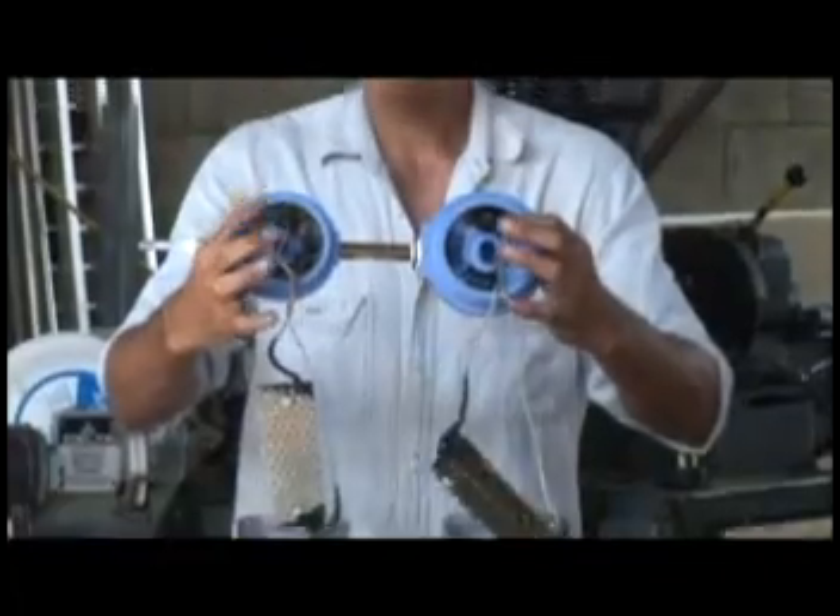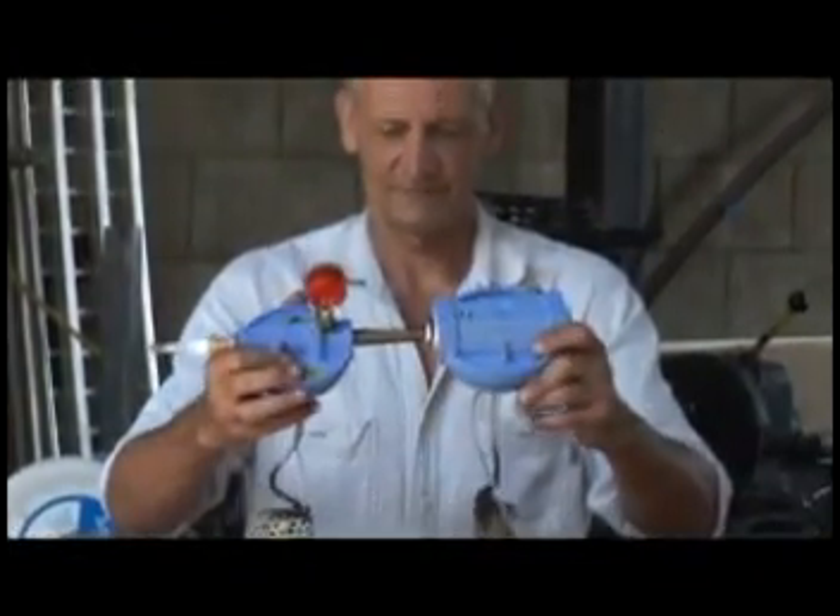Our arrays are attached to their terminals and they're going to go right in here. But wait — we need to add our aqueous solution, which is a fancy word for water. Use distilled water. Regular water has too many impurities and will make a cloudy solution and scum up with brown garbage everywhere. Just don't do it. You may experiment with it at first, but try to stay with the distilled water. So now we're going to pour the distilled water into our canisters.